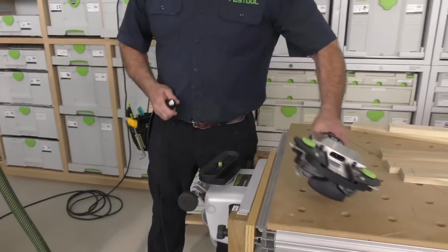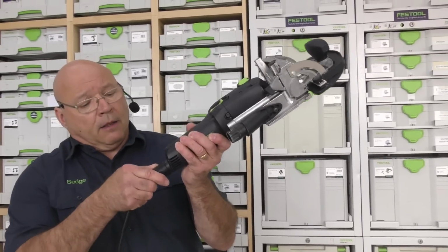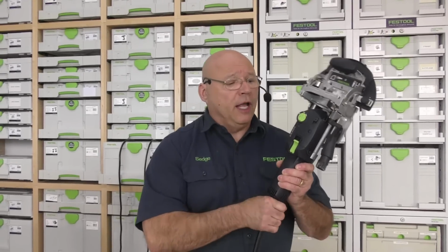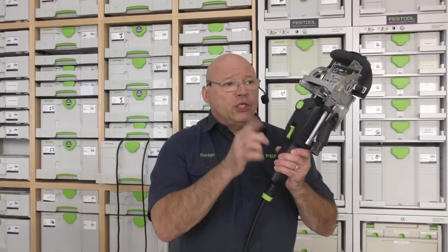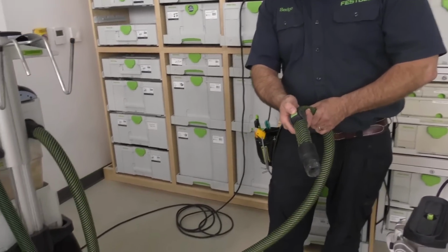Okay? So the only thing I gotta do is get some power to her. I'm using a 6x40, so I already changed the bit yesterday on there. Okay? Remember, when you put a plug-in cord on there, it's a full quarter turn, and you always make sure your machine is cycled off before you put electricity to it. Okay, let's see if I got power here.